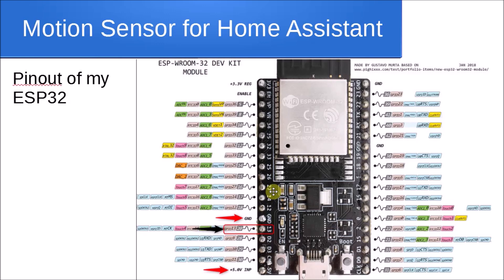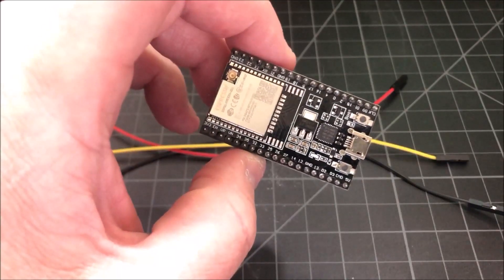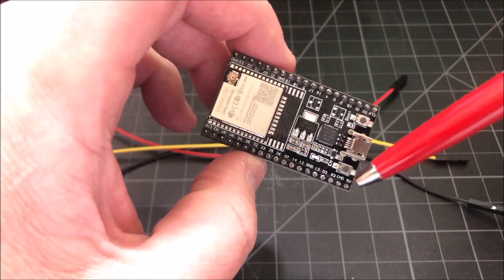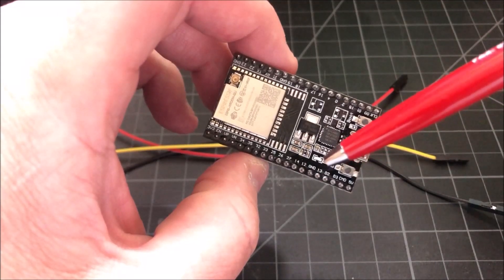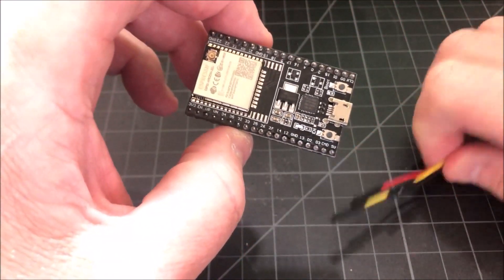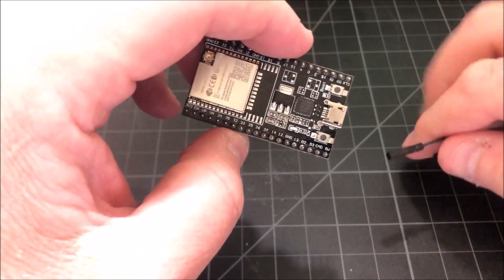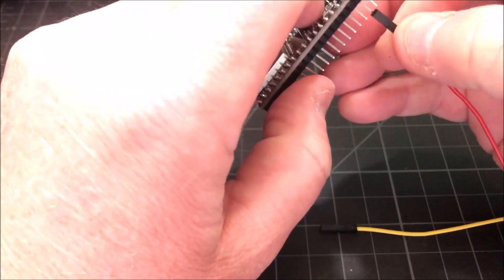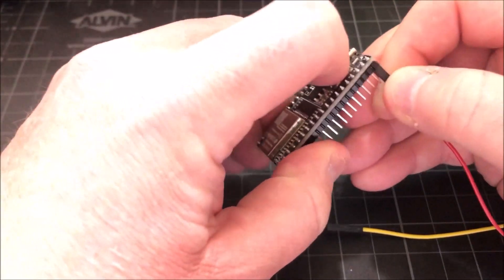On my particular board, I'm using three pins where 5V is at the first pin, digital 13 is three pins up, and the ground pin is there as well. Here is my ESP32 in real life: the 5V pin is here, digital 13 is here, and ground is here. I've got three wires — red, black, and yellow — with female ends on both sides to hook up the sensor. I'll just push the red wire on there, just like that.